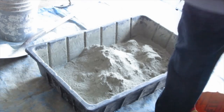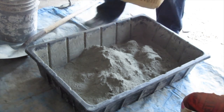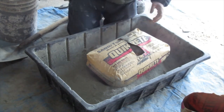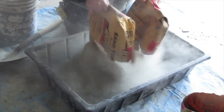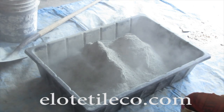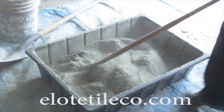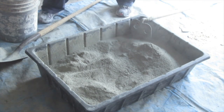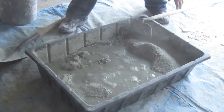I thought I'd upload a video just to explain how I install a mud floor in a shower pan. Normally I just use a Quikrete sand topping mix. This works fine — I've used it for years and years. It's a little richer than it needs to be. The mix in these bags is like a ratio of 3 sand to 1 cement, whereas usually deck mud is 4 or 5 of sand to cement ratio. But anyway, this stuff works fine.